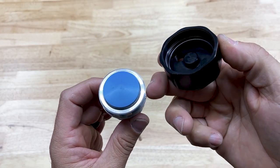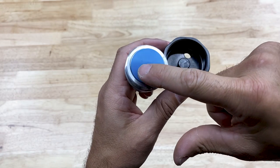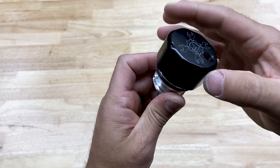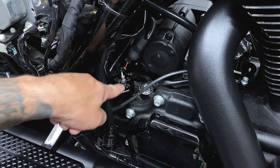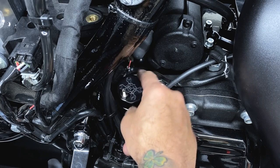And the cap has an o-ring on the inside for further sealing. On the underside of the cap, there's a standoff that puts pressure on the center of the umbrella valve for a tighter seal, but still allows air to escape. Installing the cap, it has a set screw on the side. This allows you to set the hose fitting in a desired position and lock the cap into place, making it easier to screw and unscrew.